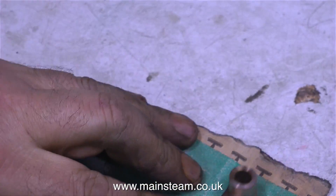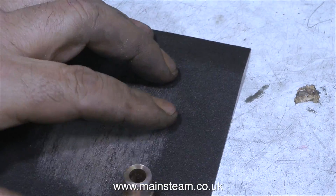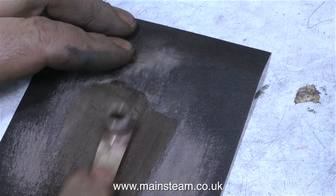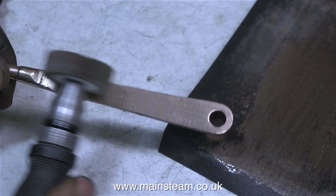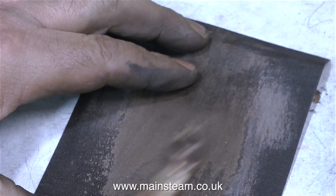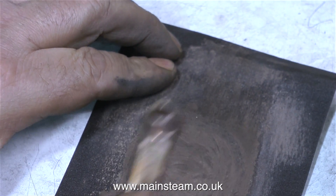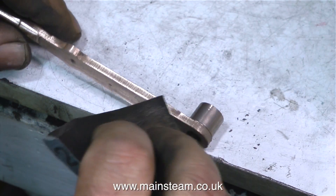Now it's time for the big clean-up to remove any marks on the reversing lever. I put the pipe union in the vice so that when I used the hammer to tap the mandrel out, the reversing lever didn't get damaged by the edges of the vice jaws. This clean-up job really did take a long time. First of all I used a horizontal 4-inch belt sander, followed by the vertical 1-inch belt sander, followed by a flapper wheel, and in between that various grades of sandpaper — sometimes with oil, sometimes with water. It was an experiment to see which method gave the best finish in the shortest time, and the answer was none of them; it took ages. I'm sure some experts will tell me I'm doing it all wrong and there are better ways requiring large and expensive machinery, but this is the way I did it.